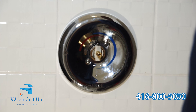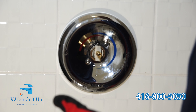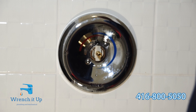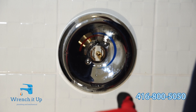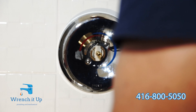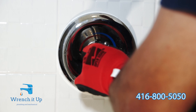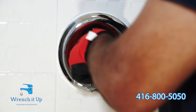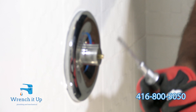We opened up the water and there is no leak happening. We confirmed that the water is on, and if I turn the handle, the water will flow — so our issue is solved. Now we're going to assemble the parts back together. Next is the sleeve, which we push back in, followed by the stoppers.